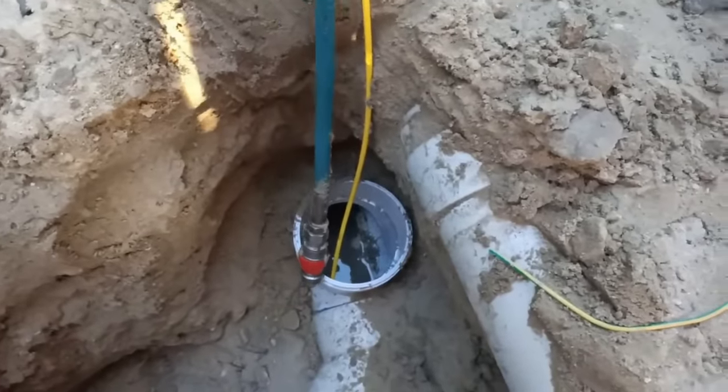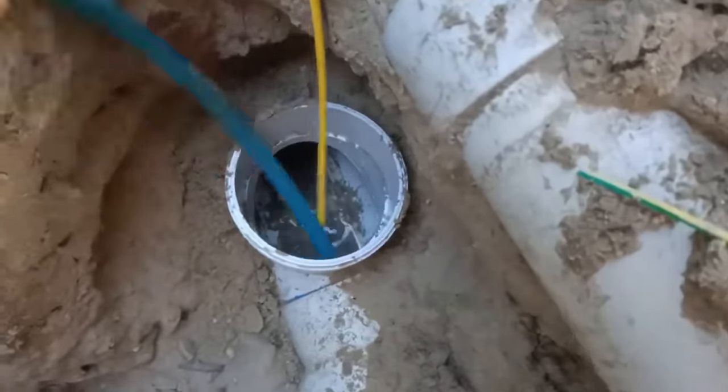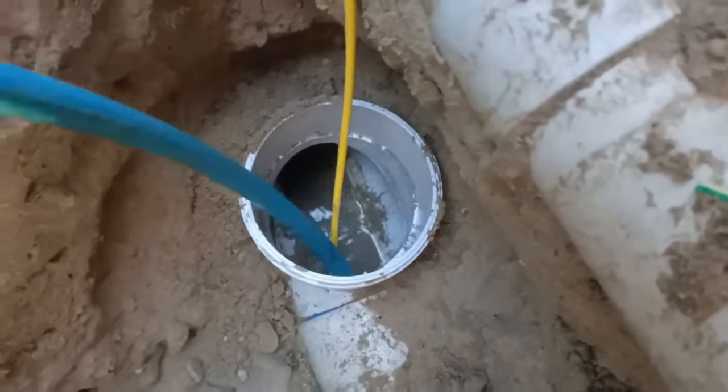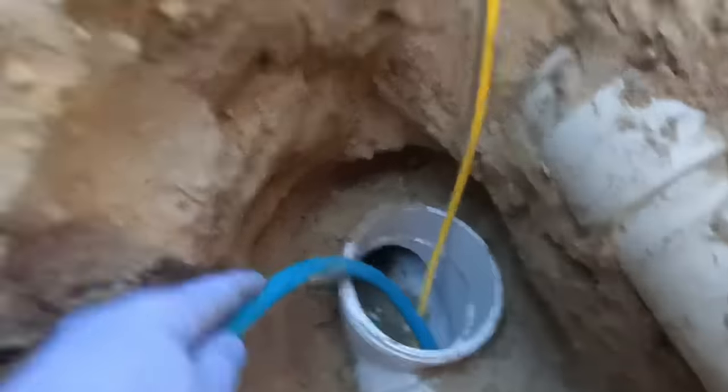Yeah, I'm going to send this jet upstream. We'll try and jet this towel or rag or whatever. We'll send her backwards and try and pull her out. I just got to make sure that we don't jet it too far and we don't want to jet it past this inspection opening. I just want to get the jet just in front of the camera there. There we are. All right, guys, we meet again inside the drain.